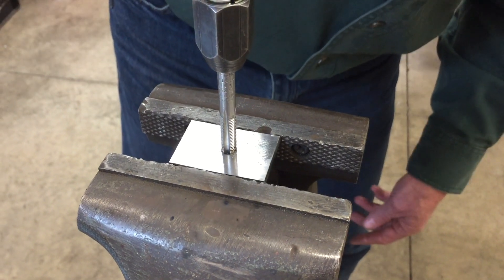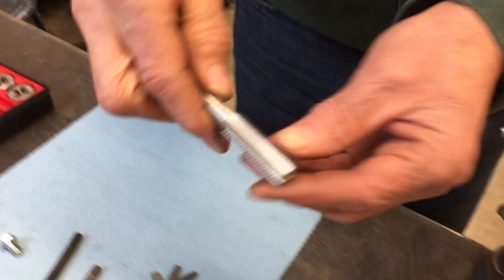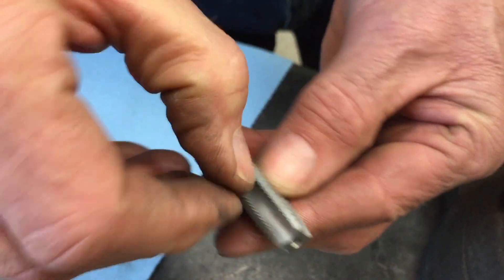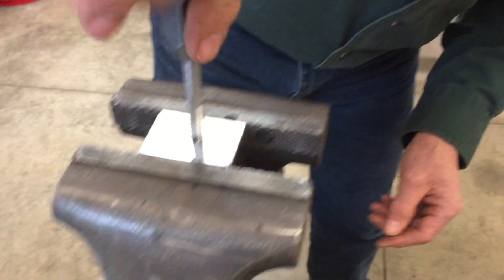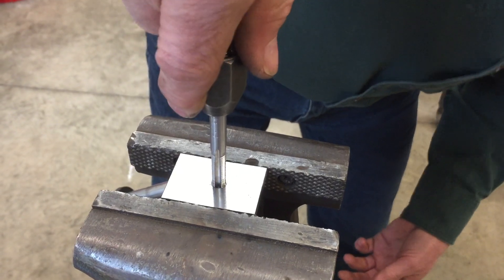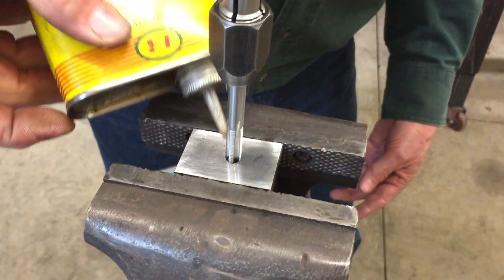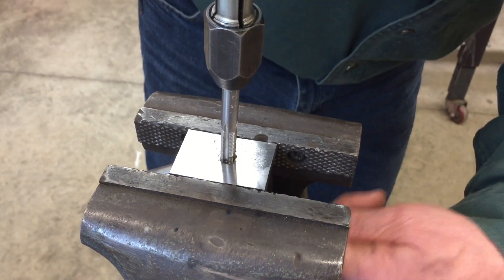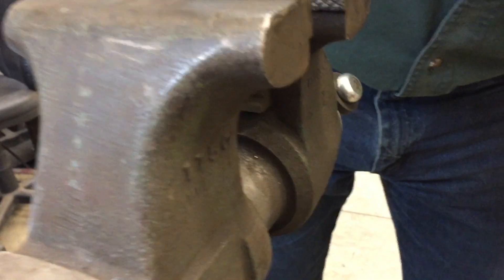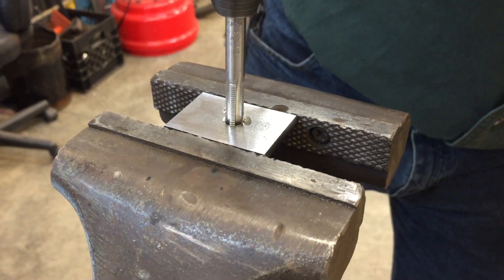The reason you're backing it off — you can feel it when you turn it the other direction. What you're doing is taking all the cut material and putting it into these little flutes. It's really important because it gives you clean material and doesn't get in the way of cutting the new threads. So you keep turning it a little bit, back it, turn it, back it, give it a little extra cutting fluid, turn it, back it up. You can see the chips fall out down below — they go into those little flutes. So go forward half a turn, back it up, forward, back it up, forward, back it up.